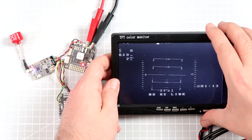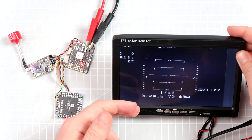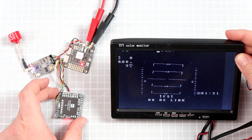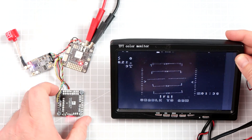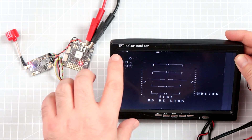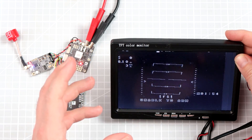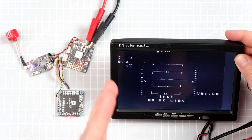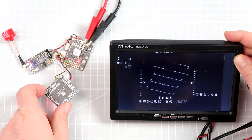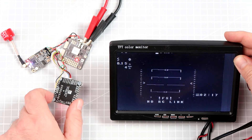So everybody hoping for some amazing HD image quality — well, this is how it works. We are still limited by the analog signal, limited number of lines, PAL or NTSC. It's not HD picture out of nowhere, but I would say this is a real step forward. The best part is that developers of iNav, Betaflight, or other software can add graphical elements without modifying the OSD firmware itself — it works as a canvas. You just paint on it, limited only by the creativity of the flight software developer. Better? Perfect? Not yet. The DJI system is definitely better, but one step at a time.